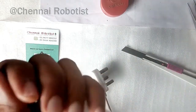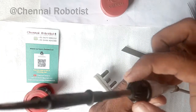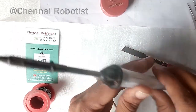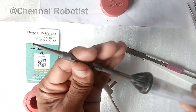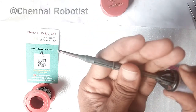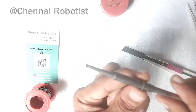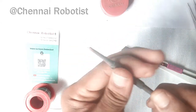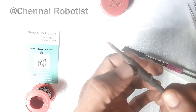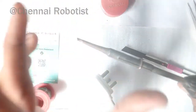If your soldering iron gets fused, you just have to open the three screws and change the rod, which is available in the market. Commonly though, if the soldering iron is good you don't need to change the rod and can use it for many years. What you may need to change is the bit — you loosen the ring, pull it out, and if the rod has been eaten up past a certain level you replace it. A replacement bit costs around 20 to 30 rupees in the market.